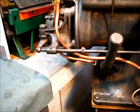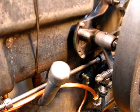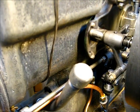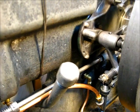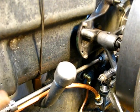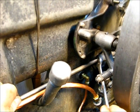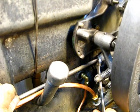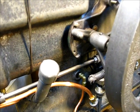Now I'm going to go right in yonder — that's a nine-sixteenths. That nut right there — now's the time to lock that up. It's nine-sixteenths. I'm going to hold it right up here, put the wrench on there, and I want to tighten that up without letting it turn the pushrod. Tighten it up good because that's where it's going to be at. Okay, that's real good. Now we've got that tight. The flywheel's in the same position. This is in the same position.